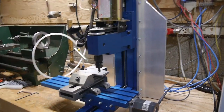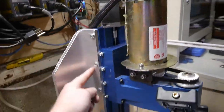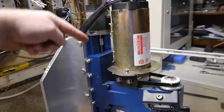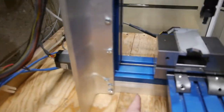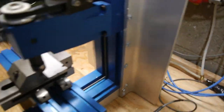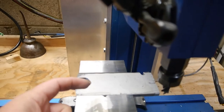We're about to test out these new braces. We have five bolts tying into the z-axis way on each side, and a total of six bolts tying into both the bottom C channel and the top Y way. With these modifications combined with this stiffener, we're going to go ahead and rerun this.